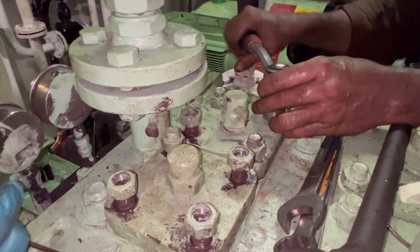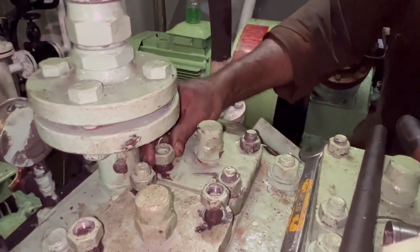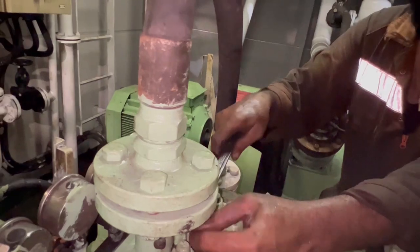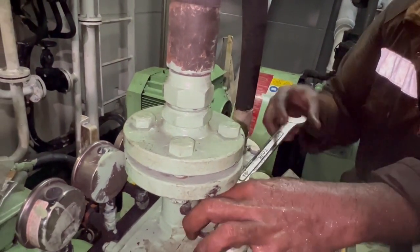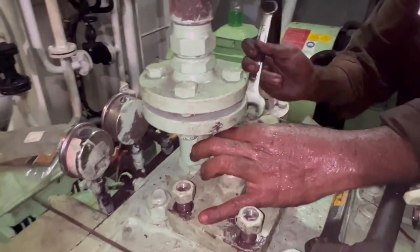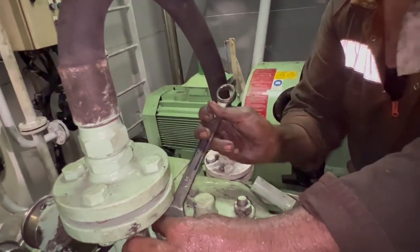The main maintenance job for the main air compressor is routine maintenance of the valve — sometimes you have to check whether the valve is okay or not. Some makers say to directly change the valve after 2000 hours or 4000 hours. There is nothing to worry about doing maintenance work on the main air compressor. Especially for fourth engineers who are new to the ship — don't panic. Just follow the manual and the maker's instructions.